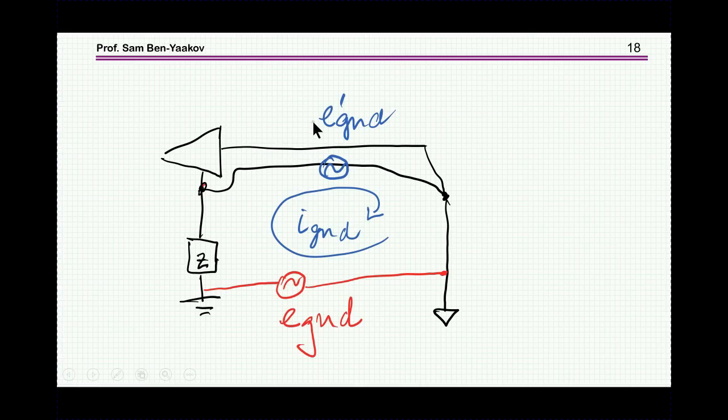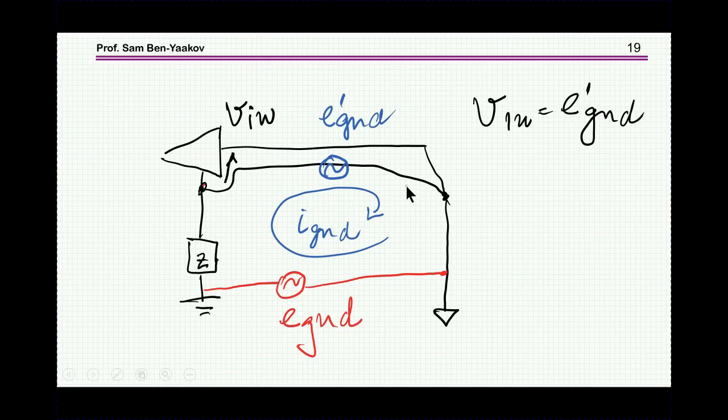So now we do have on this line a voltage difference because there is a current here, and this line has some resistance or impedance, and therefore there is a difference. And consequently now the voltage that you measure by the amplifier is actually this difference that is starting from here, here, here, here. The amplifier sees the voltage here, and this is what you see on the oscilloscope. So this means that oscilloscopes are sensitive to common mode voltages. It really depends on the quality of oscilloscope.